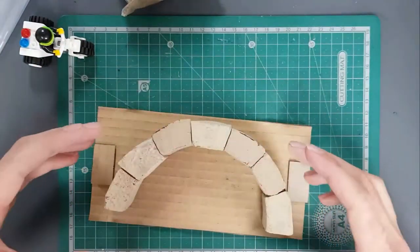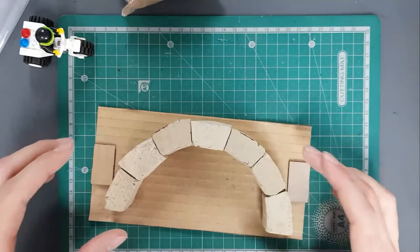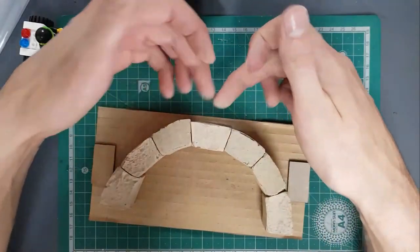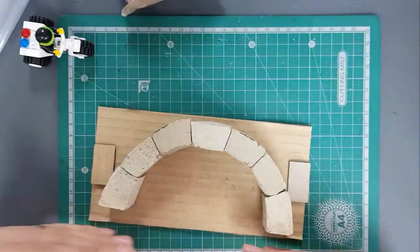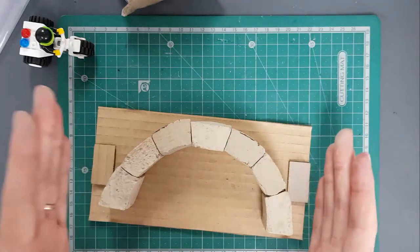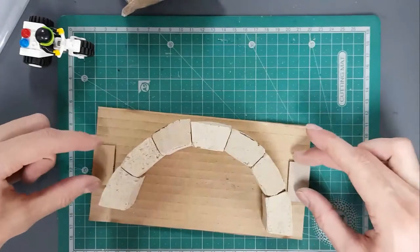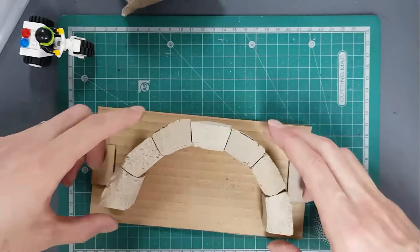The top part is called the keystone — it's the final piece placed in to lock the whole arch together and allow it to take and spread load. The bottoms will want to push away from each other when forces press down from the top. An arch is only as strong as the support structure holding it in place, because if the bases are not locked, they'll fall out and the whole thing collapses.